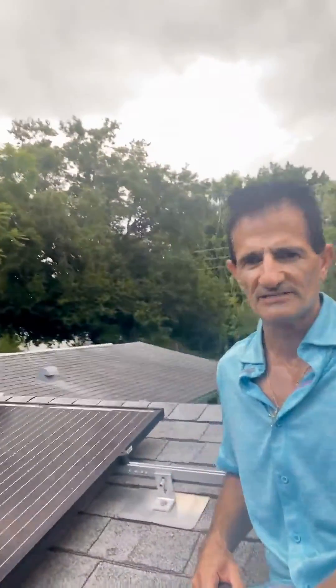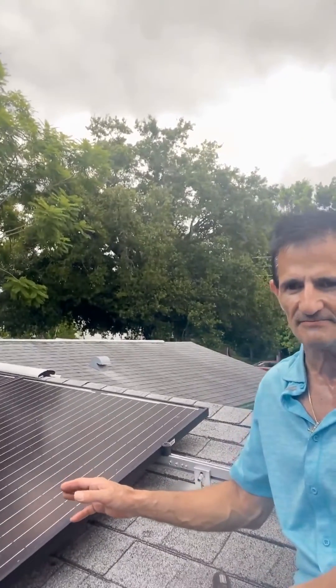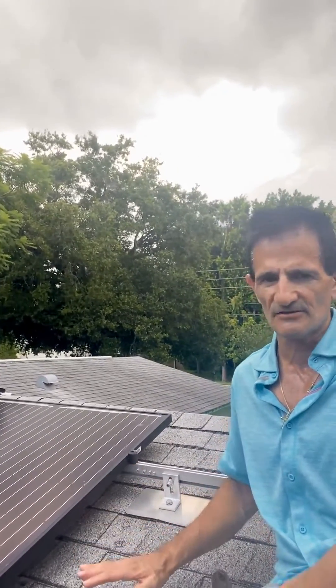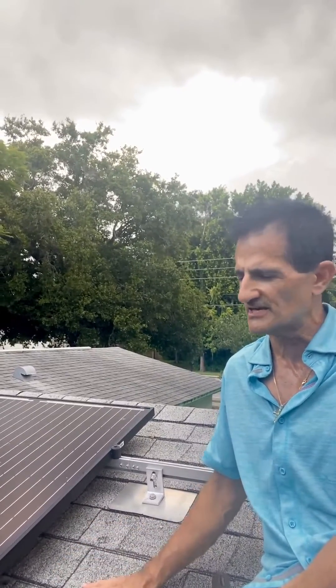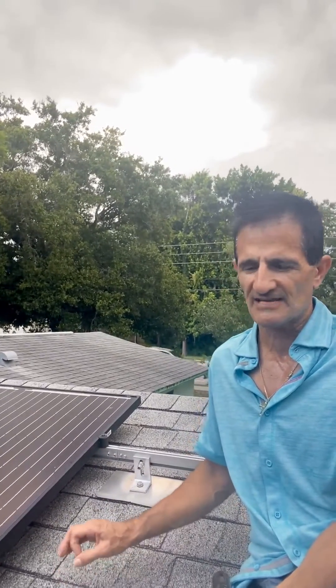What I would tell you is, the solar panels have a 25-year warranty on them. If your roof is almost shot and needs to be replaced in a few years, you might just want to get a new roof. That way you avoid having to spend $3,000 or $4,000 later on to have the solar system removed and reinstalled — that's worth about a year's worth of electric bills.